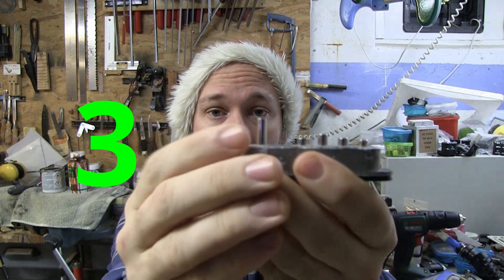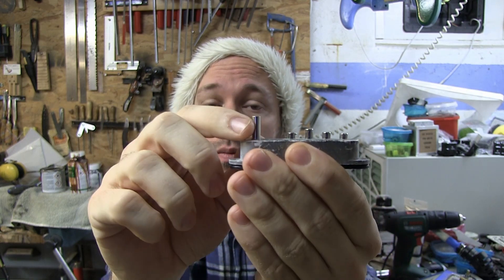The next thing: if you take a close look at your pole pieces they might just be square to the edge, and you can change the pattern in the magnetic field by how you round them over. You can take the pole pieces out — we're talking about cheap pickups here — put them in your drill, make them spin, and use a file to round them over. Depending on how much you round them, you can change the magnetic feel and how the pickup takes up vibrations. You can't really go back on this, so be careful. I'd suggest taking off less than you think you want to, or go crazy and change the pickups afterwards if you don't like it.